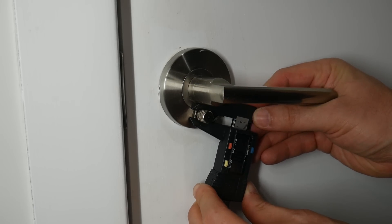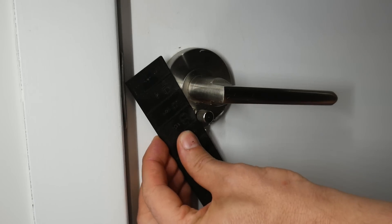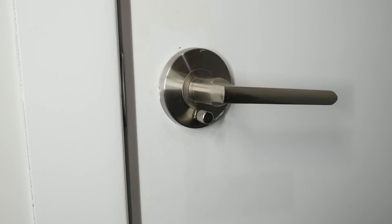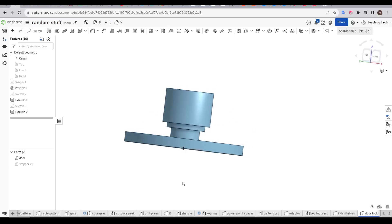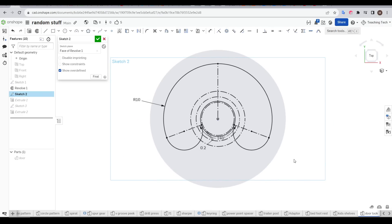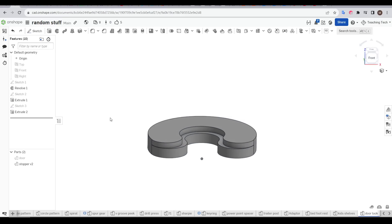I got out the calipers and took a range of measurements. I also used this thickness gauge, which I'll link in the description — it's super handy for measuring the gaps where the calipers just won't fit. This allowed me to jump into Onshape and model the relevant components. I could then sketch a simple shape that was closely matched to the locking pin, extruding it upwards and then adding a second sketch and second extrusion. And that's all that was required to come up with a solution to address this problem.